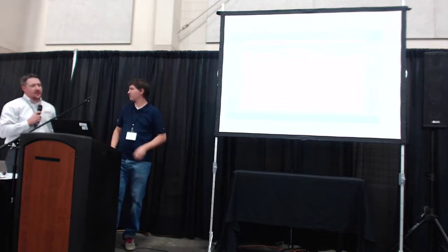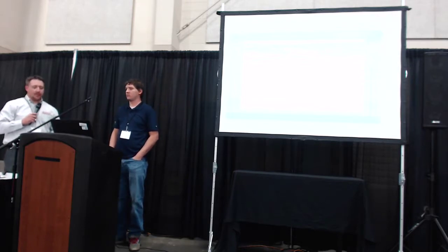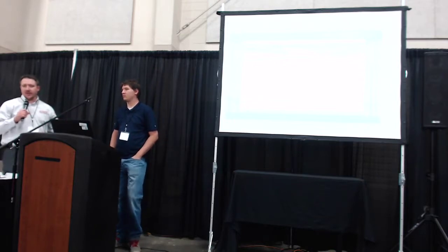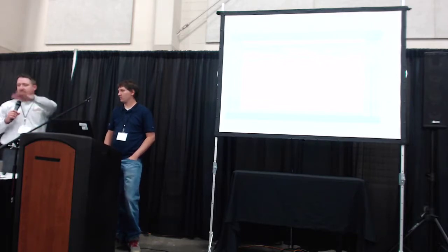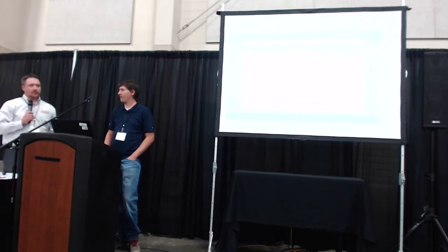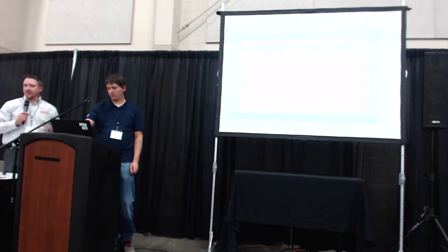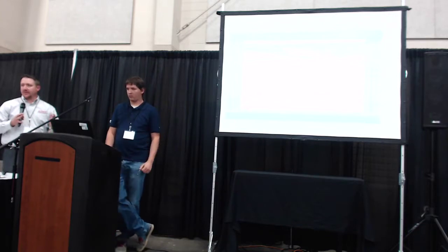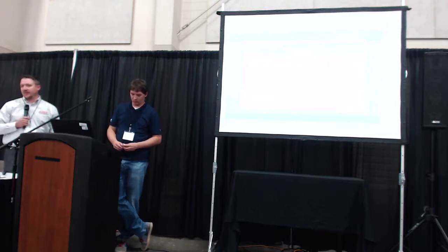And one more thing on soft spots. We just did a job recently in one of the cities here in the valley where there were fairly large patches, but around all the manholes, after the asphalt was placed, after temperature was dropping, everything was coming in pretty well except for around the manholes. And the rollers would go over it, and you could just see it still doing this after 2 hours. So it really kind of pays to drive a piece of equipment over it in those areas just to make sure that it is compacted, because sometimes they just don't, because of going up next to box culverts, anything like that. They won't bring in any of their heavier equipment because it won't fit, obviously, but they need to put that compactive effort in there.